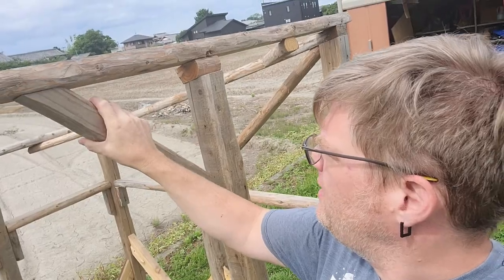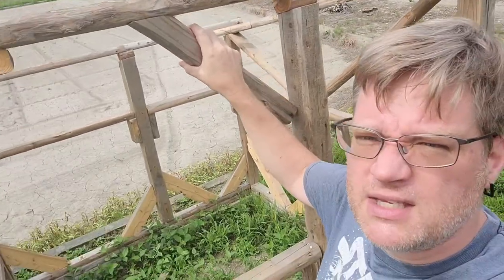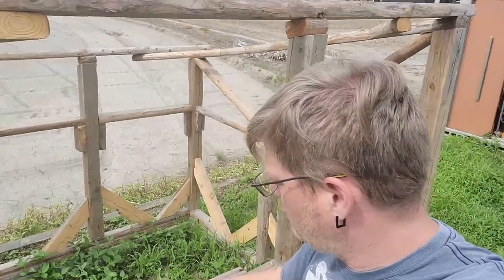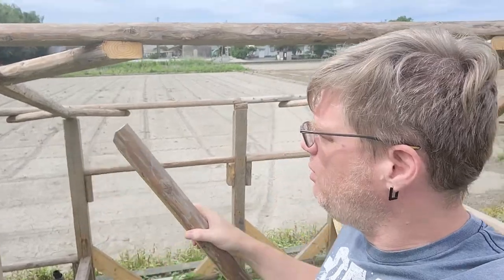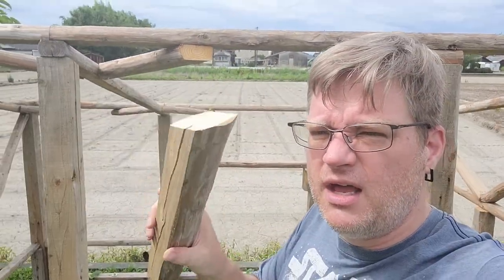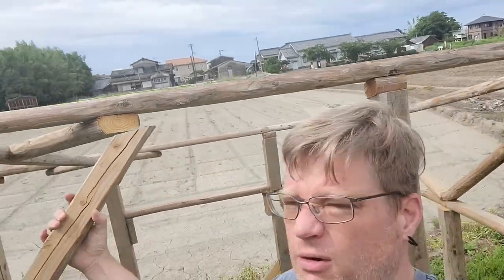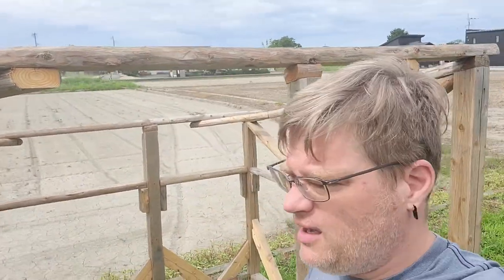And that way, yes, it comes in nice and straight. I cut the other end to 45, and I am good to go on that one. All right, so I've got it figured out. I cut whatever kind of piece I want, take twice the length, cut it with this angle in the middle, and you get one to go this way, and one to go that way, and you've got both sides.